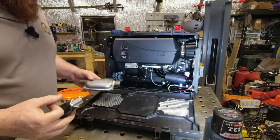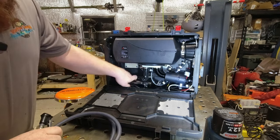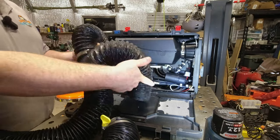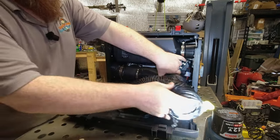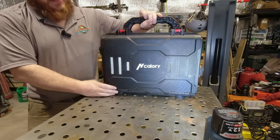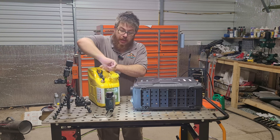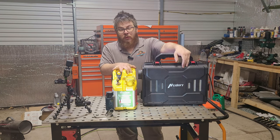The beautiful part of this system is everything packs away — and I mean everything: muffler, exhaust pipe, power cord, fuel line from fuel tank to diesel heater. This also includes a junction in my vent because while I'm up in my rooftop tent, Murdoch sleeps inside my car, so I stick one vent in the window for him and one in my rooftop tent for me so we're both nice and warm. Everything's packed away, you can lay it on its side, you have a fuel tank here, the lock shut will not open and leak — and there you have it: a leak-proof diesel heater system for overland camping. No more diesel-covered sleeping bags for Andy.